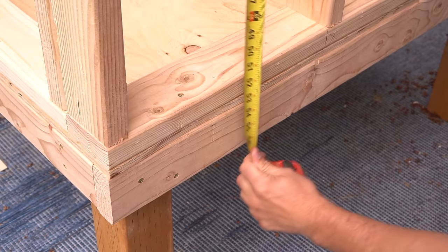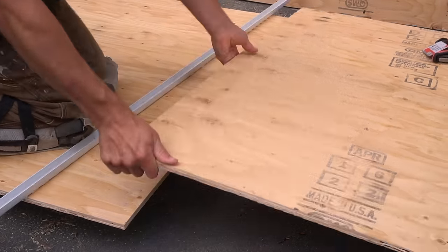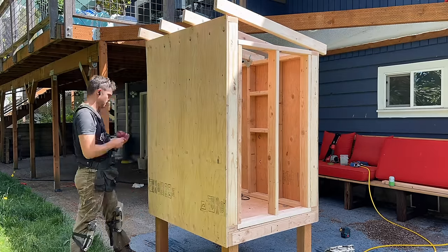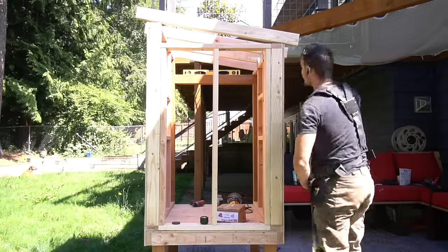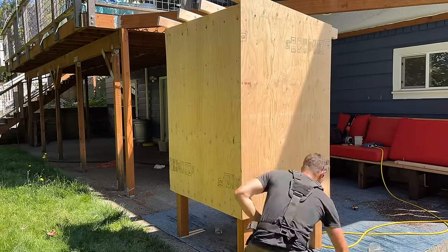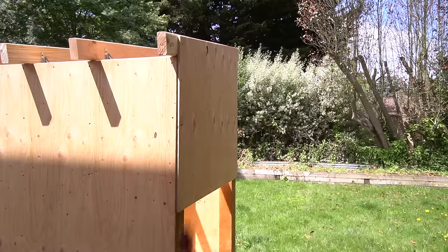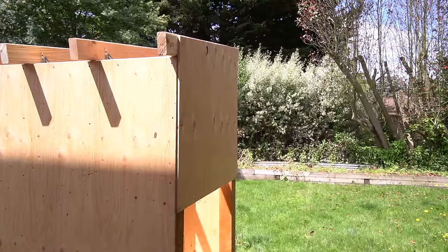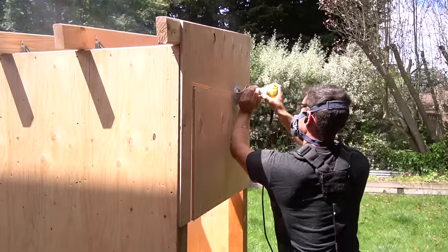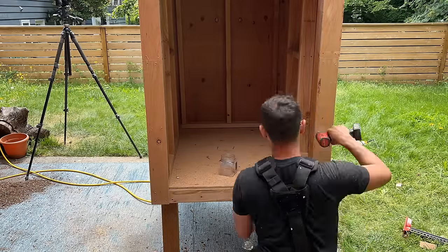We have all of our framing taken care of at this point, so I'm moving on to our sheathing. In order to reduce plywood waste and make fewer cuts, I made this structure 48 inches exactly, which is why I only needed to make one cut for this entire panel, as well as one cut for the secondary side. Of course we had to make a couple cuts on the back side because this side is angled at the very top — this is also why I have our roof rafters aligned with the framework, so we can sheathe all the way to the very top and make a nice cohesive transition. As I make my way to the front side, I use some wasted pieces, and to make a perfect flush opening, I highly suggest using a router with a flush trim bit. Once the sheathing is done, we can move on to our roof.